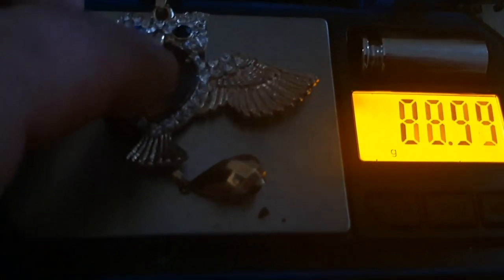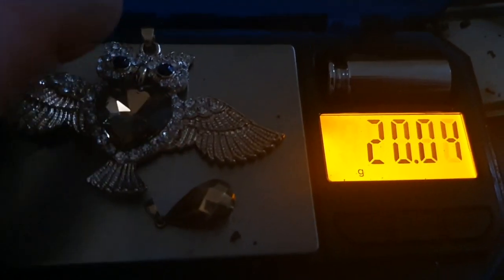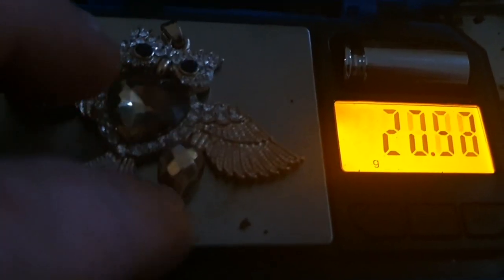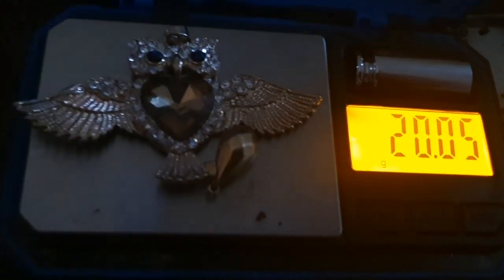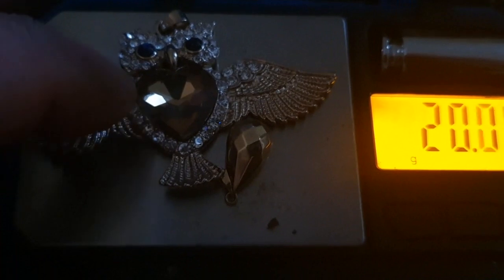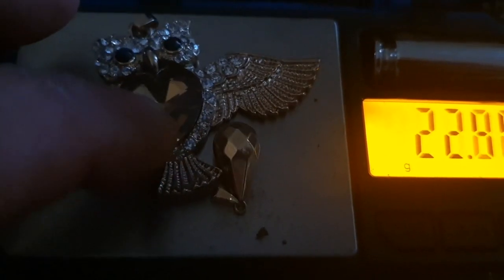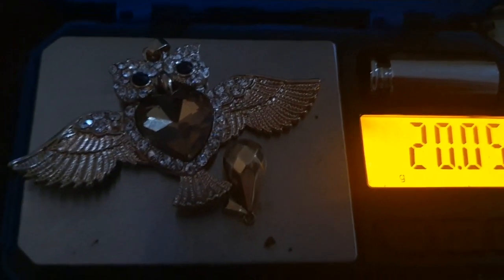If this is rolled gold, gold filled, gold plated, it's certainly not carat jewelry, then that can also be treated the same way. So both of these items can go straight in nitric acid to dissolve all the base metals. No need to inquart any of this. And all these little stones, they're probably just junk, but my girlfriend does art, so she'll take these. It's too hard to get them out now. I'll let everything dissolve and just collect them in the bottom of the beaker afterwards.